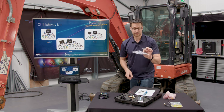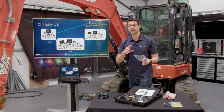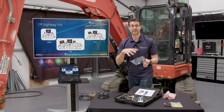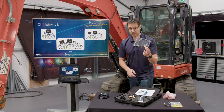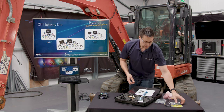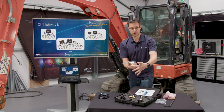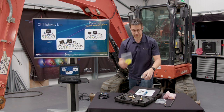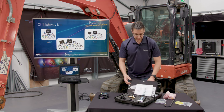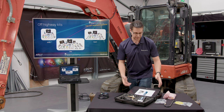The flexible pipe can be used for crankcase pressure. Again, if you've got any wear on the actual cylinders and the piston rings themselves, we'll obviously get excessive blow-by. Put this into the dipstick tube, and you'll start to see that and you'll get those pulses coming back through. Again, if you're doing any fuel work and you're using WPS to put the flow through, we're going to need a bleed return, hence that pipe being in there as well. Okay, so that's part of the expert kit, so some nice non-intrusive testing is possible with all of that.